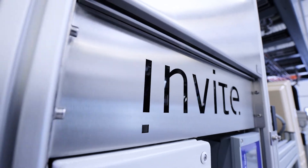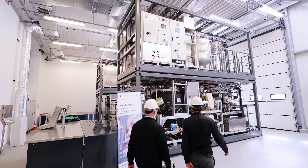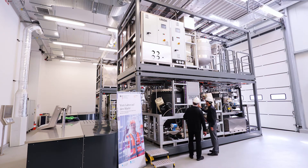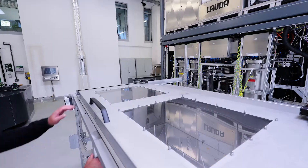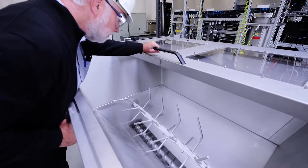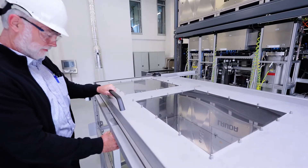23 electric motors drive the various pumps, feed apparatus, and stirrers. The unit is also divided into different module blocks that can be connected using an electronic bus system and centrally controlled. The overall synthesis process is separated into 88 sub-steps that run one after another in a fully automated sequence. On closer inspection, the system is therefore anything but simple.